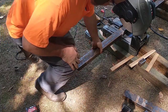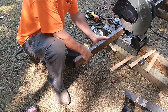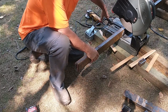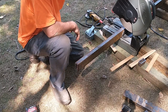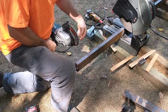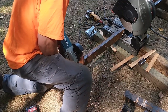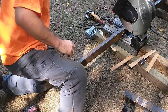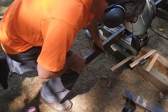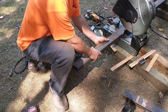I don't like cutting with that, but it cuts a whole lot faster than the four-inch. I could do the math one day and figure out which one has a higher surface speed — a seven-inch cutting wheel or a four-inch — because the seven-inch operates at around 8,000 RPM and the four-inch at 11,000, so which one has a greater surface speed? You've got to be careful near these thin edges because the saw is going to want to jump out into that thin spot. You have to maintain absolute control over it.